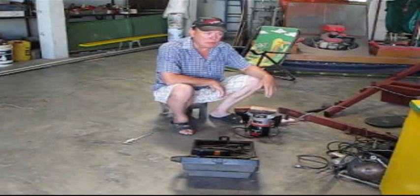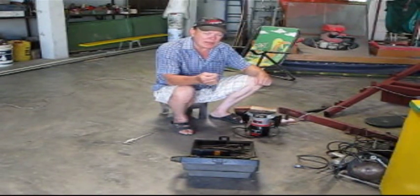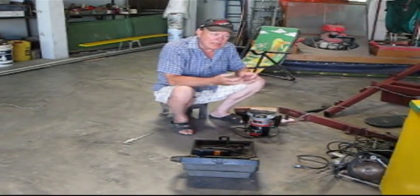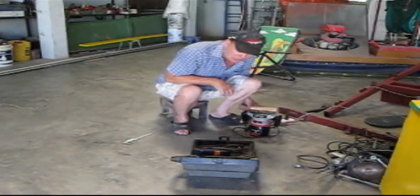The reason why you cut a slot in the boom is, when you have a sail that has a bolt rope along the bottom of the sail, you can take that bolt rope and slide it into the whole length of the boom, and it remains trapped in this little channel. I'll show you exactly what it is.